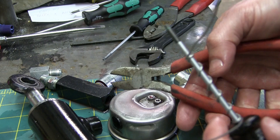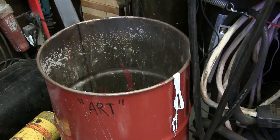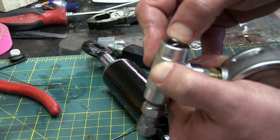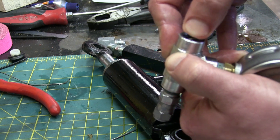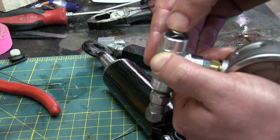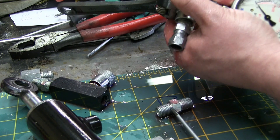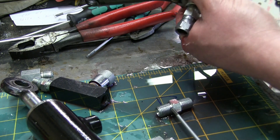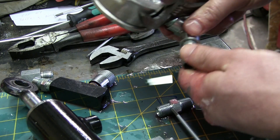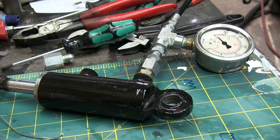There's quite a bit of half-assery involved, but if it saves the driller's round, bonus is bonus. This wire is soft as American cheese — not hardened wire — so there's very little actual spring to it. It's mainly plastic deformation; what you want is elastic deformation, but there's not much to it. You've got to get it pretty close to the right length. Now, in the previous setup we had a way to get rid of the oil without cracking a line, but in this setup there is no way to get rid of the pressure without cracking a line. The pressure will remain until we allow some of the oil to escape by loosening this fitting. Let's give it a try with the homemade check valve.